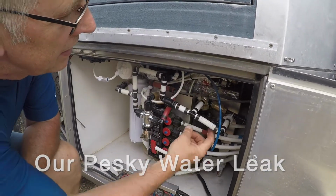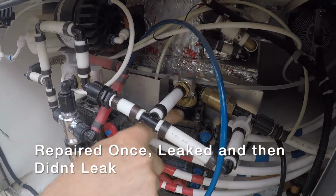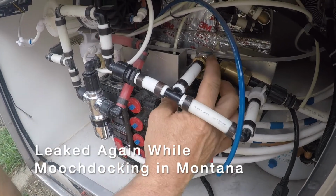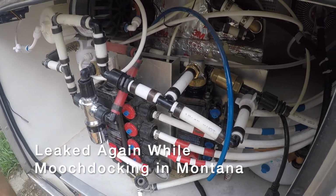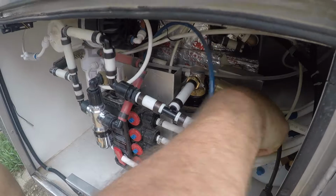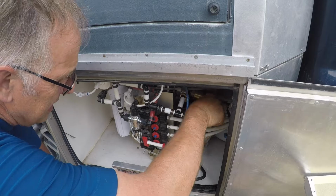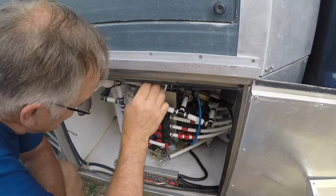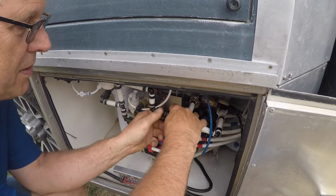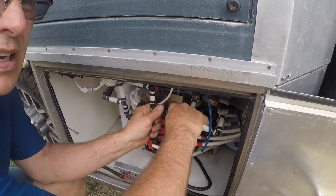So I've got a leak where this brass fitting goes into this aluminum adapter, and this is a special fitting for this manifold that I built, and unfortunately the adapter scrapes all the sealant off before it can enter into the threaded section. When I built this, I built it such that little pieces of line can be removed separately, so I can work on leaks. This has increased the number of fittings in here, but made it a whole lot easier to get a hold of something.